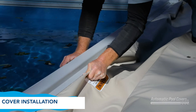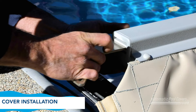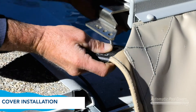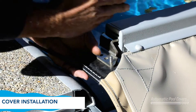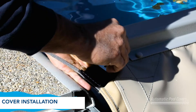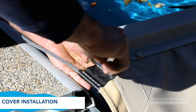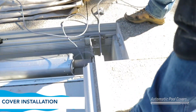Work toward the opposite side. Insert the remaining glider bracket into the lead edge dowel in the same slot as you did on the opposite side. Attach the bracket to the glider with supplied hardware. Tighten until snug, then back off slightly to allow the glider and glider bracket to pivot slightly as the cover travels across the pool. Feed the glider and the cover into the track while gently pulling on the rope.